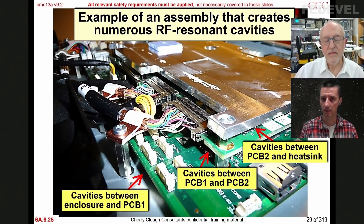There's lots of work going on with absorbers now, especially with 5G and 6G and very high frequencies — higher than six gigahertz. You can do a lot of absorbing with quite a thin sheet of plastic with embedded ferrites and bits of metal or carbon inside. If you want an absorber that works at 300 megahertz, it's usually going to be about two or three millimeters thick and quite expensive, but at 30 gigahertz it can be just like a piece of sellotape.